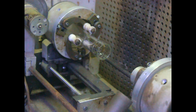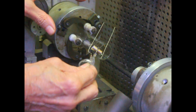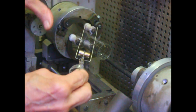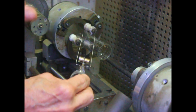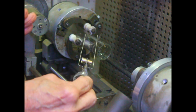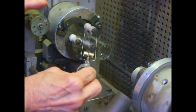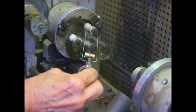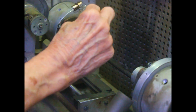Got to cut it off to the correct length. We have to have everything ready, because once we cut the cathode out of the other tube, it'll start deteriorating. The cathode, we've got about 10 minutes that we can work with it before it ruins. So we have to have everything ready to go, so that when I cut that cathode out and weld it onto here, we're ready to close it up and seal it.